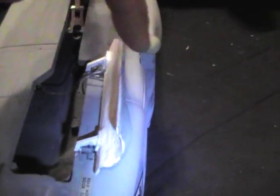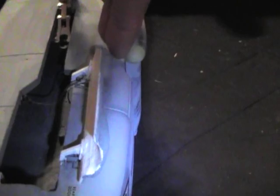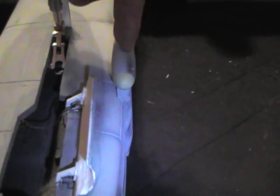I actually think that you could use the original stock little black spring-loaded hinges that come with the door to do this. You just wouldn't get the offset feature like I've got with this one, where the gear door actually swings back, open away from the fuselage, further away from the wheel. Which is kind of the way the real one does. If you look at some of the other ones, you'll notice that this door right here opens up almost real close to the camera gun, the gun camera right here, which this is supposed to simulate. A little drill, made some slots in there for it to guide down through there, and then that's about it.